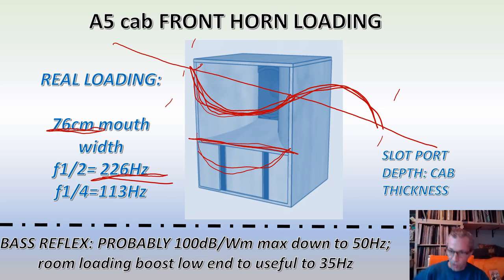If you live higher up, lower down, humidity changes, temperature changes, then the exact value will change. And this is the reason why musicians have to tune their instruments, because depending on the temperature and altitude, the sound waves that a tuned object supports change, because the wave carrying capacity of the air is different based on these parameters. So the frequency that it can support is roughly 226 Hz. It can go higher by a few hertz or lower by a few hertz, depending on your room temperature, whether it's summer, winter, is there a storm coming, not coming.